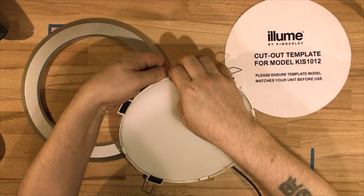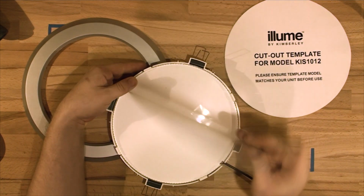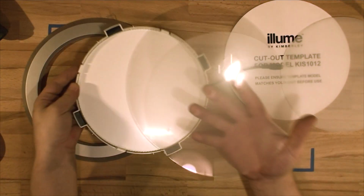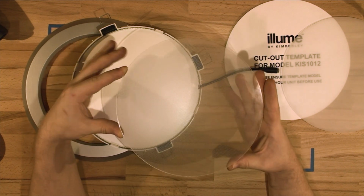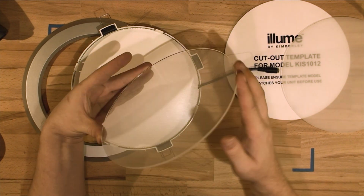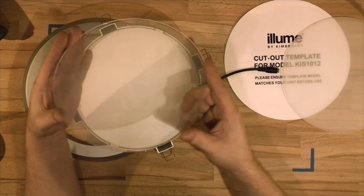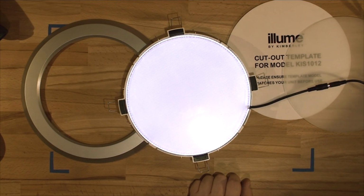We've got the diffusing plate, just a simple diffusing plate. Underneath we have a glass. That's what LED panels or LCD panels usually use. It is just a perspex glass with white dots etched onto it, so when the light illuminates it from the sides, those dots light up. I'll see if I can actually show you that without the diffuser. Let's plug it in again. So yeah, there we go.